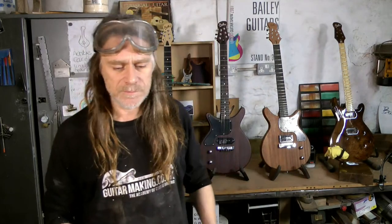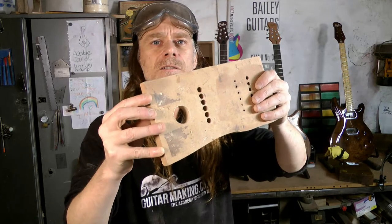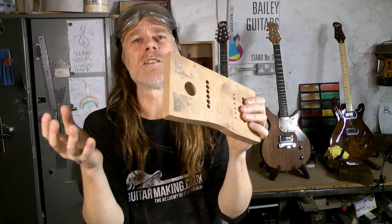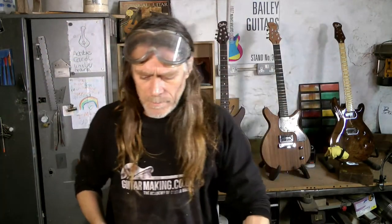So Robin, ages ago, asked, can you make any suggestions how to drill a vertical hole with a handheld drill? Yes, you can use a drill guide, which is what Clinton suggested. He said a drill block guide, which you can also use for ferrules, for example, which is what we've got. Also, there's one brand of drill, I think it was a Bosch drill that I saw, that actually had a spirit level on the back of the drill. Maybe that's something you could consider. You could buy a small spirit level and put it on the back of your drill. As long as your bench is flat, you can hold your drill square with the spirit level on your drill. I've seen it done, or a drill guide, but you need a pedestal drill to make one of these in the first place. That will hold your drill square as you drill.